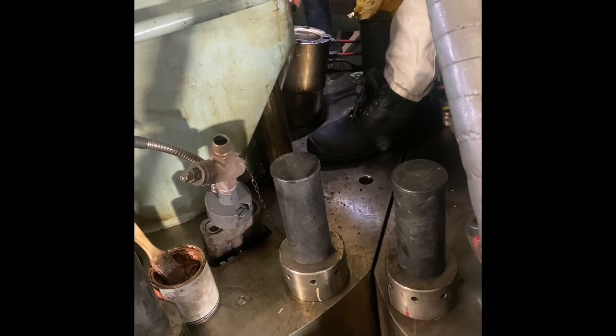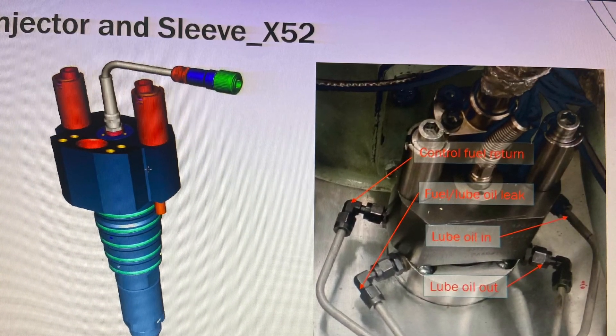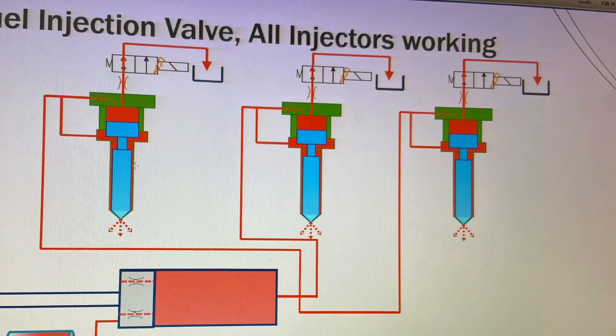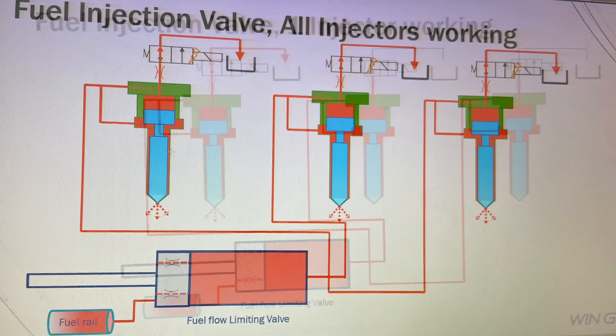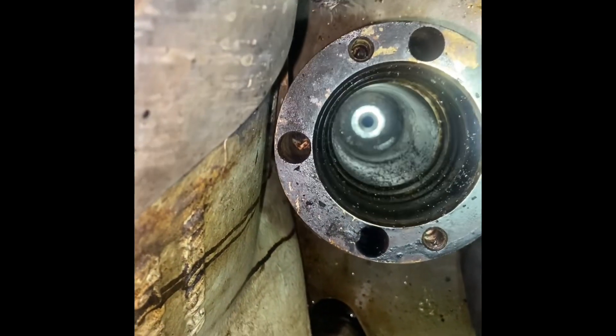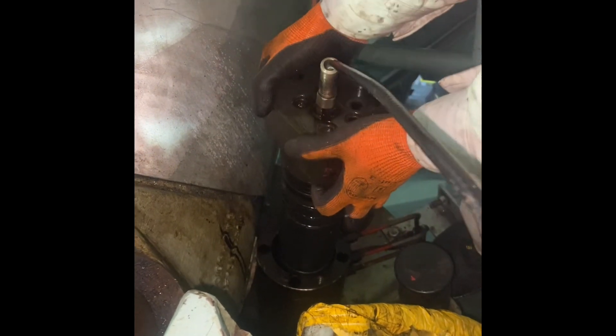Finally, I will explain how the direct control injection valve works. The injection valves are installed in the cylinder cover of each cylinder — three injectors per cylinder. The injection valves spray the fuel into the combustion chamber. The ECU controls the solenoid valve and activates the pilot valves of the injection valves, which controls the timing and quantity of the injected fuel related to the power output. When the pilot valve opens, the high pressure of the supplied fuel opens the needle into the nozzle body, letting the fuel flow through the holes in the nozzle tip into the combustion chamber as a spray.